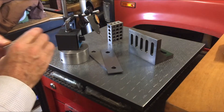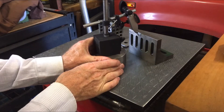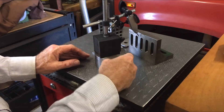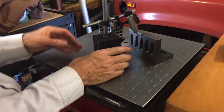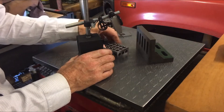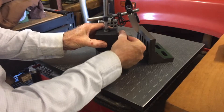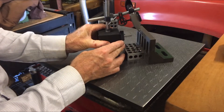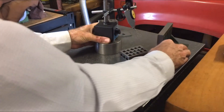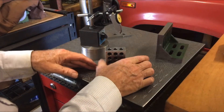I've got a couple of parallels here as well just to space things out. I'll set the height of the test indicator to be around the top of my little angle plate - that way we get the best measurement we can. If I set it halfway down we're missing out on half the room to find a variation. I'll set one of my one-two-three blocks flat on the surface and get the magnet roughly set so we get about half a turn on the dial - not too far along on the scale.